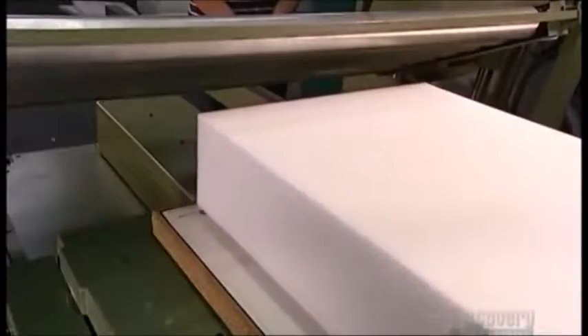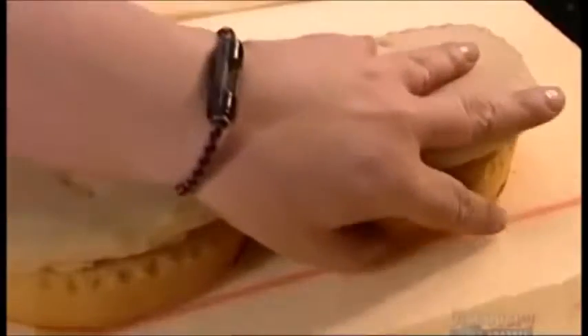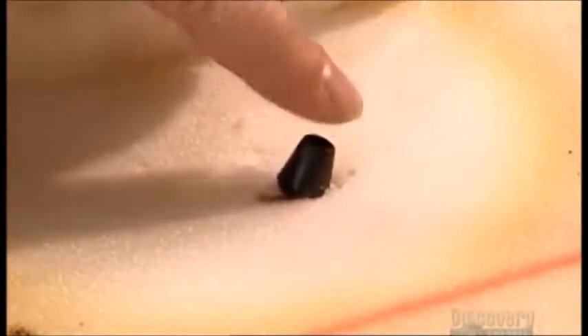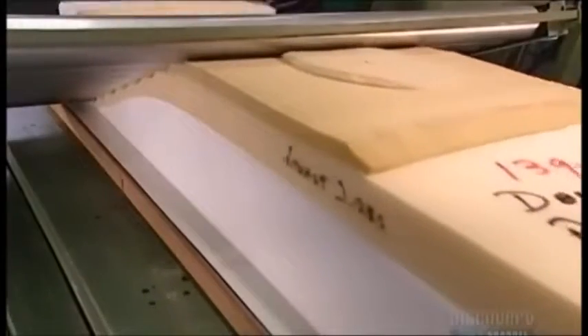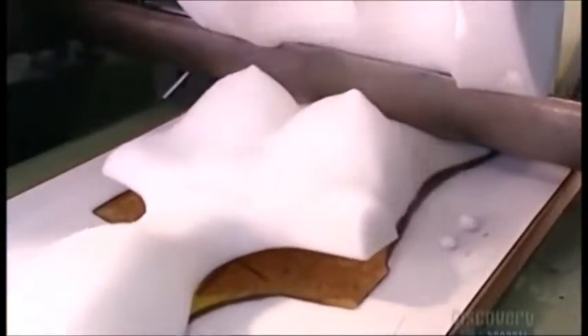For the head and torso, they use a foam slab measuring 139 by 43 by 14 centimeters, and a foam pattern that includes shapes for breasts and a belly button, and grommets to shape the nipples. This foam pattern is impressionistic — these mannequins are not meant to be anatomically correct. Here's the pressure cutting machine close up: nine rollers compress the mold, soft foam, and pattern slabs together, forcing them through a paper-thin opening and slicing away up to 15 centimeters of foam. True to form, Lady Swing pops up on the other side.